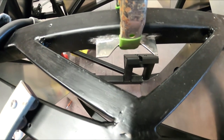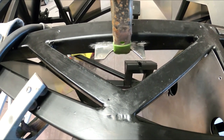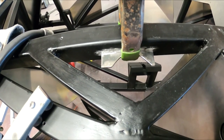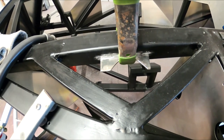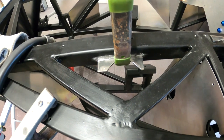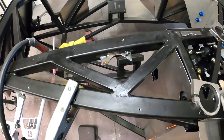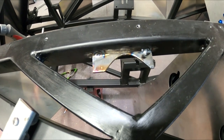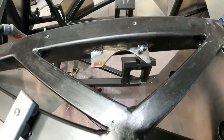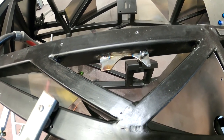I've got the plate held on with a clamp here. So I'm just going to tack both sides, then we'll level it and then I can actually run a bead. We're just going to weld one side. This thing's not structural — it's not holding a lot of weight, just a few ounces of brake fluid. So we'll run a bead here and see how this turns out. We've got two tacks. We're going to level this thing, make sure it fits, and then we'll run a bead. So we're getting there.